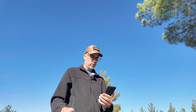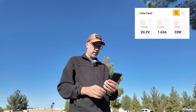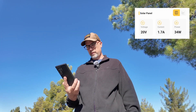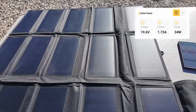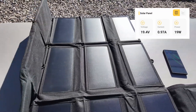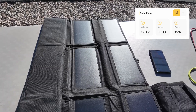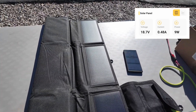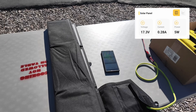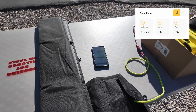Let's take a walk while we look at the solar panel and get the sun out of my eyes. We've got 20.2 volts, 1.63 amps, and 33 watts. Now let's block off some of the panel — we've dropped down to 0.9 amps. Opening back up: 1.73 amps. Closing down: 0.97 amps. Closing farther: 0.61 amps, then 0.48 amps, then 0.28 amps, and this should be close to zero. Still getting some voltage, but no amps.